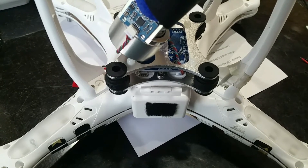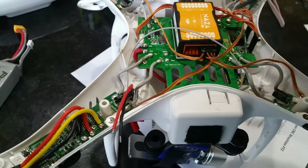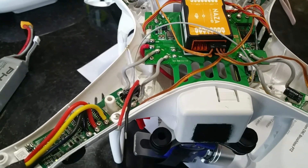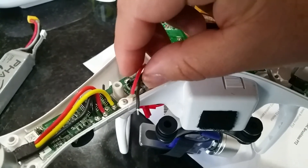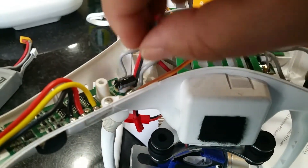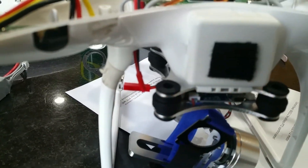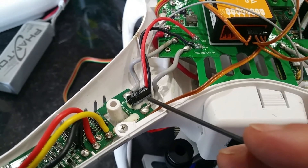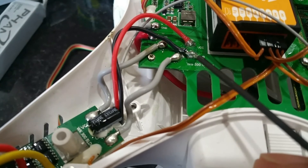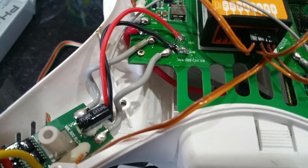Now we've got to figure out how to run power up into the copter. After starting a small house fire, I pulled all the silicone off, which is where those two wires were coming off. I clipped the wires there, then took the wires that came with the device and ran them up through the leg like that. I'm going to solder here, hopefully not start another fire, so I'll be able to make the connection for power right there. I pulled the wires through the little rubber grommet, ran it up, soldered the connections, then covered it with some silicone to keep them there and insulate it.